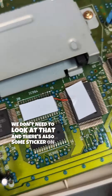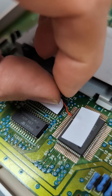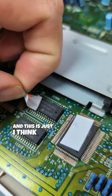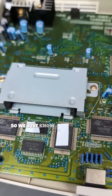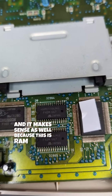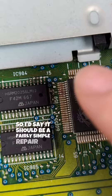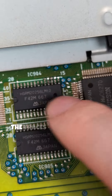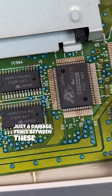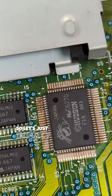There's also a sticker on here which looks like there was a wire going somewhere, and this is just taped down, so we know there's been a repair here. This makes sense because this is RAM, so it's very likely the video RAM. I'd say it should be a fairly simple repair to just look at the traces in this area — it's very likely just a damaged trace between these two that was repaired originally with this wire.